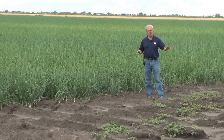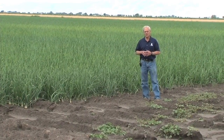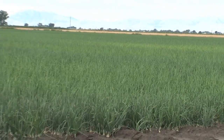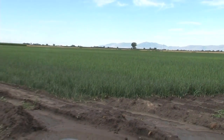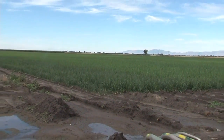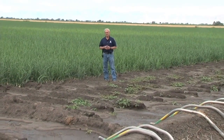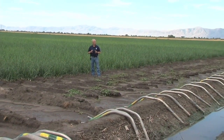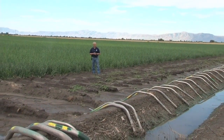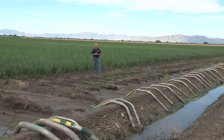There's no pump involved and no filter involved, but there are other problems. The yield on these fields would most likely be less because of the non-uniform irrigation. The fertilizer requirements would be more if fertilizer is applied through the irrigation system, again because of the non-uniform irrigation. And it's a little harder to keep the ideal soil moisture because the frequency of irrigation is less than with the drip system.